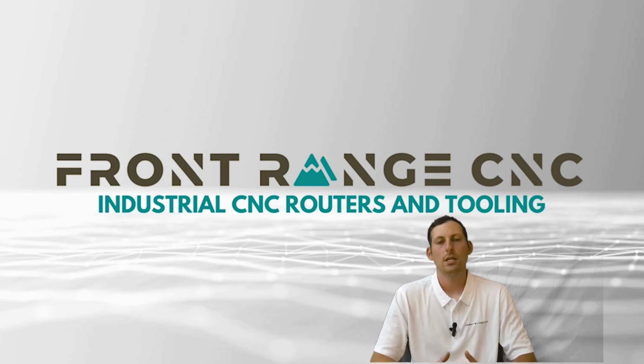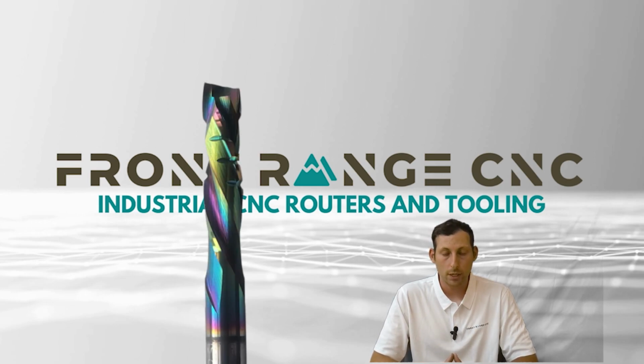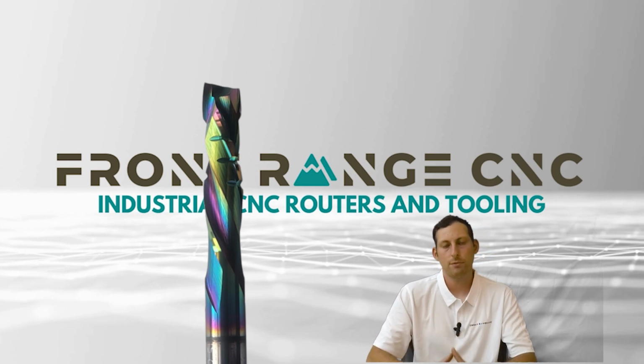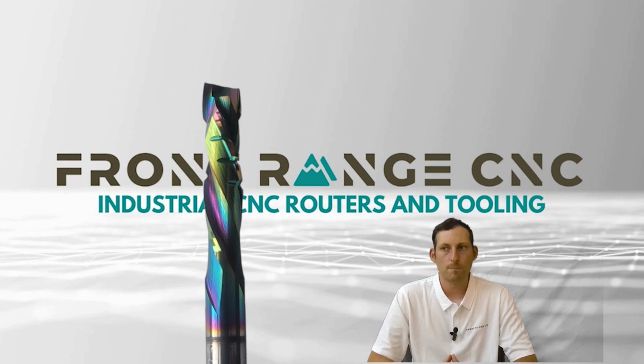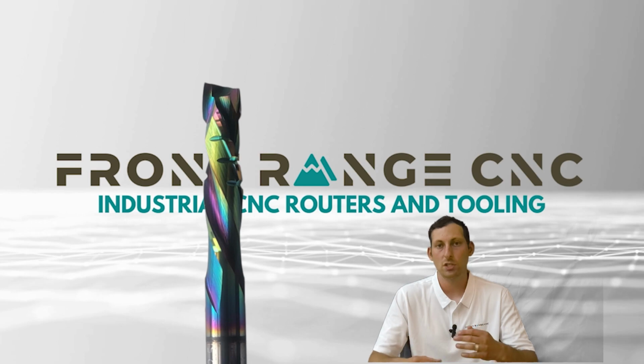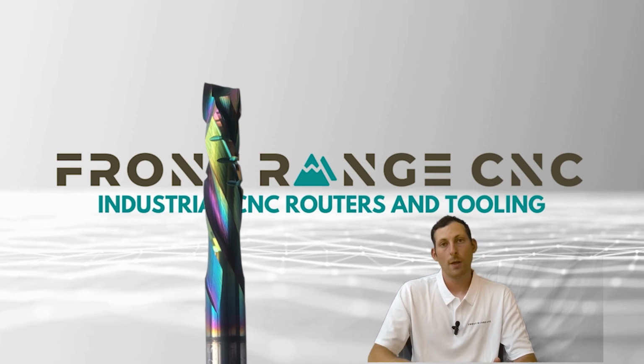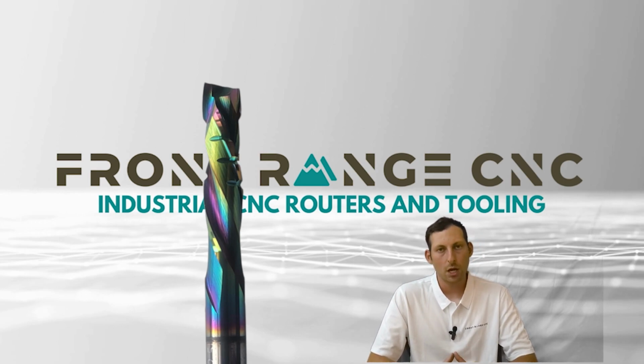The other thing is there's more and more router bits being introduced with a roughing pattern. You can see in the photo that a roughing pattern essentially is cuts on the actual router bit itself. This is sometimes called a chip breaker. Depending on where the bit is originating from, or even just that style of bit, will determine the verbiage. But a roughing bit or a chip breaker style of bit essentially will allow you to go quicker, but the edge is not always as smooth as using a non-roughing bit.